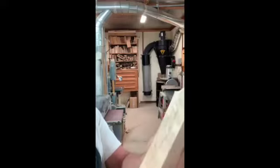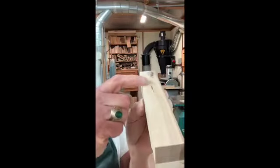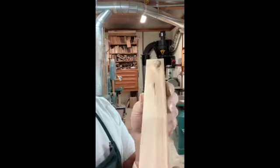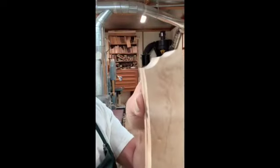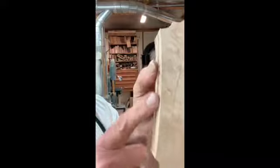So the spindle sanding is now complete. What I want to point out here is, first, this edge that will become the center of the template, I forgot to mention, needs to be dead flat and nice and smooth, because it's going to become a glue joint. And how specific, or should I say, how accurate you want to be with respect to shaping each one of these curves is up to you.